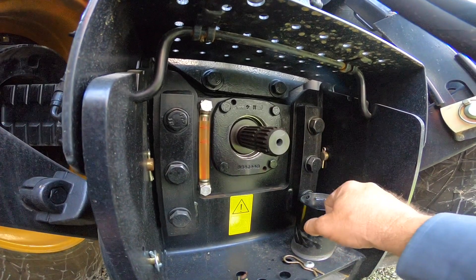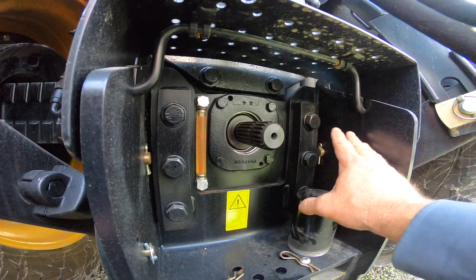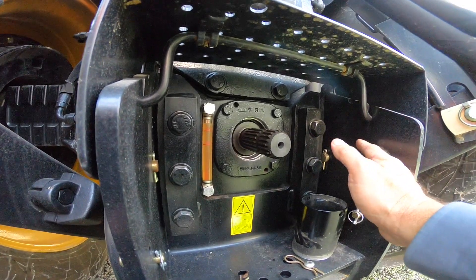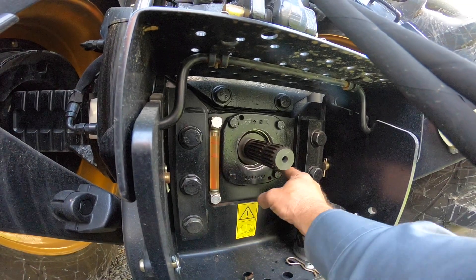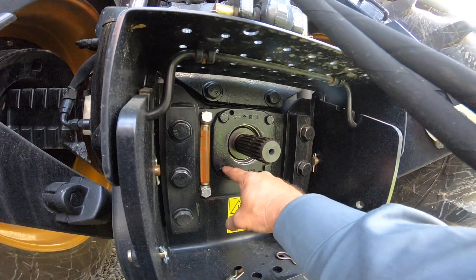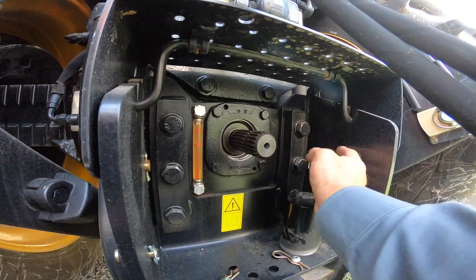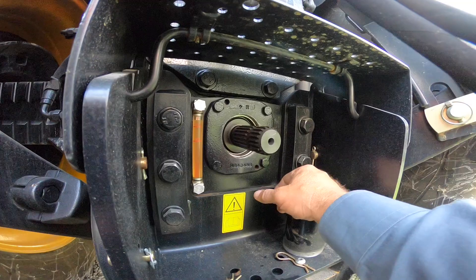To do this, there's not a snap ring, so you have to be careful. Please refer to the operator's manual. You're going to remove the four bolts around the PTO housing and screw two of them into the threaded holes — that'll pull your housing back and pull it out. Right above that you'll see two large bolts. Remove those, and there should be longer bolts that come with the tractor. You thread those in once the two bolts are removed, and that will hold the gear inside and keep everything lined up.